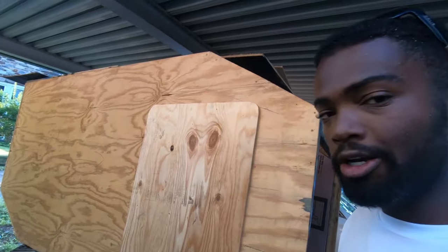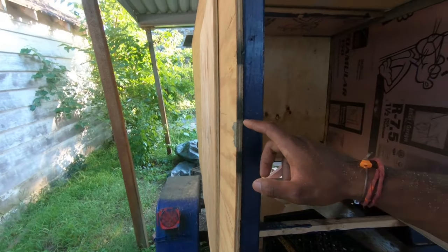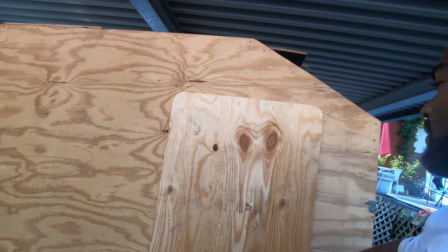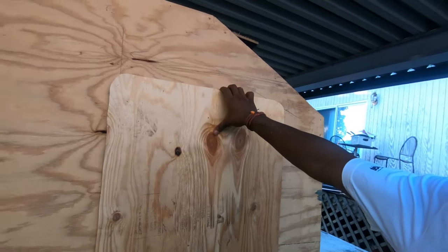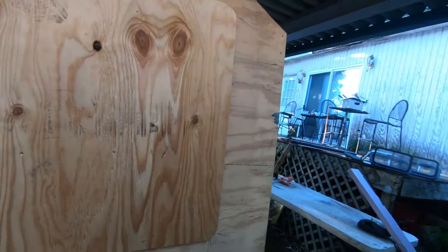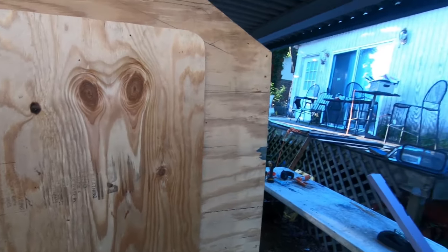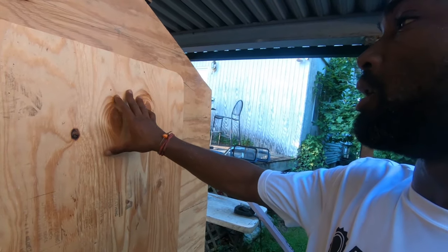She's fitted up and doesn't look half bad. The grain is obviously going in a different direction so it looks a little weird, and it kind of sticks out a bit — I don't know if I love that — but I think once everything's painted I wouldn't even think twice about it. It sits in there really good. So I'm going to take it out, mark it so I know exactly where to put it back, then go ahead and glue it up with liquid nails. It's just two pieces of half-inch plywood — an inch of plywood, liquid nails, and a bunch of screws. Hopefully that's enough to keep it from bowing out over time.